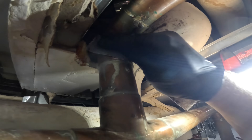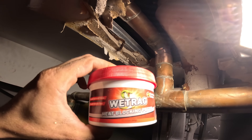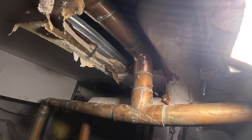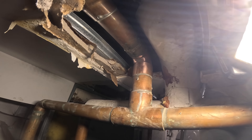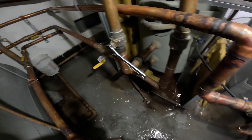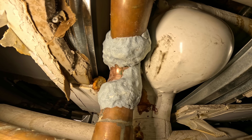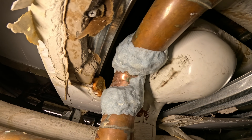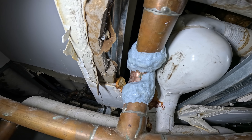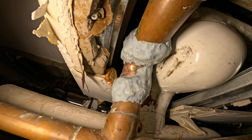I'm going to sand down this area — it's the tiniest hole — and hope I can patch it with some braze. Clean that surface so we get a good bond. Solder melts at a much lower temperature than brazing rod, so I'm going to use wet rag heat blocking putty to cover the nearby solder joints so we don't melt them. I'll concentrate the heat on that one little spot. I think it stopped — let me get ready to go.